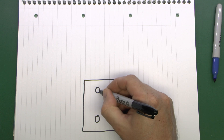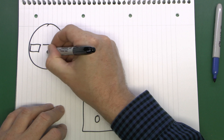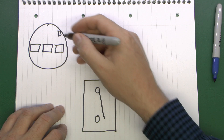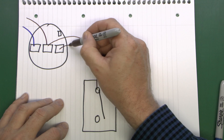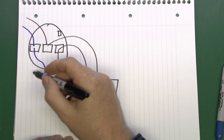So let's draw things as we've seen before. Here's our switch with the two terminals, and some kind of contact moves between them. Ceiling rose here, which might be up in the hallway ceiling, fairly inaccessible. Inside we've got our three terminals, and we've got our earth of course. Power coming in from the consumer unit: line and neutral. Then to the switch we've just got the line from the consumer unit continued through, and the other cable that goes to the other switch contact. Our actual light would be connected here between the two terminals.